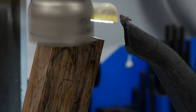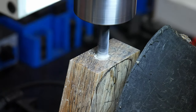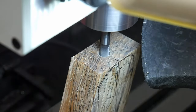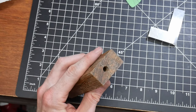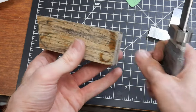I laid out my tang on the side of the handle so I could see where it should exit the back of the block. Then I milled the back angle of the handle with my face mill. Using a 5/16-inch end mill I bored about a quarter of an inch into the block, then followed up with a quarter-inch end mill to mill all the way through to the original slot on the front of the handle block. This will provide a shoulder for our finial.